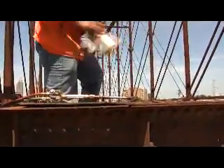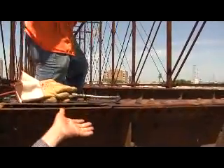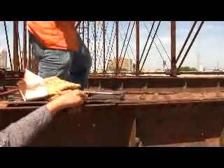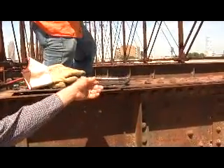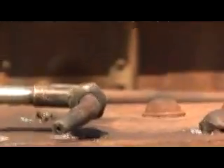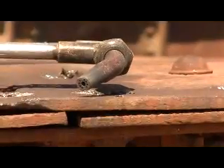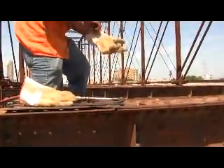Memo is going to use a special washing tip — a gouging tip. It's designed to avoid cutting into the parent metal. This tip is actually used for washing out welds and also the rivet head. It's pretty popular for rivets; they call it a rivet gouging tip. It's pretty effective.